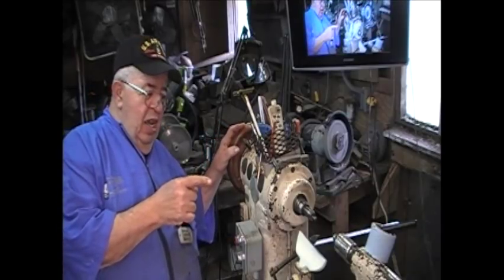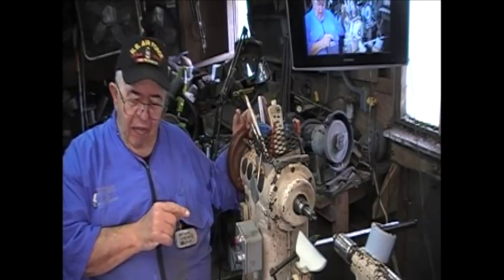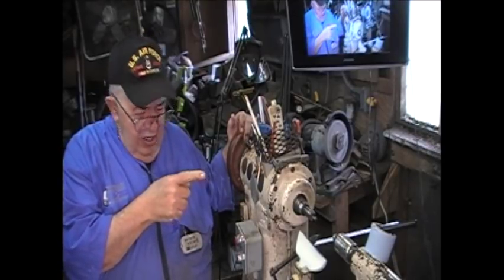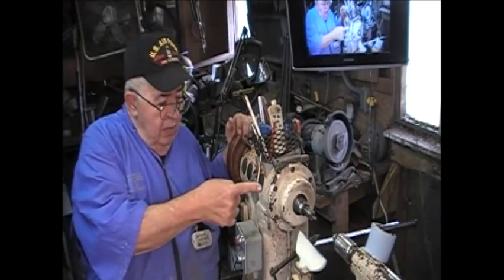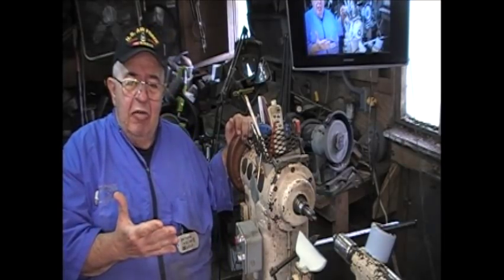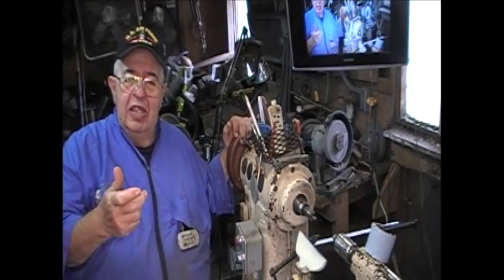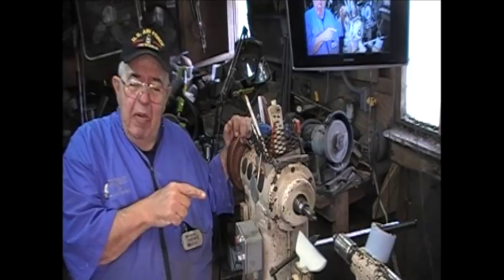But we're back on this. When I first got this mandrel, I only turned a wine bottle stopper. Then one day, I needed the top for a cane, and it was going to screw into a 3/8-inch rod sticking up out of a Cabela's cane. And I thought, well, that's 3/8, and that's 3/8. I can work like that. So I put that knob on this mandrel. Spun it on, locked it down, and it gave me a stable place to work. It didn't have to be between centers. I started to rough it in between centers, not to get any bruising to knock it off. And then when I got done, I could just unthread it off this, seal it, thread it back on the other one, and it was done. So you can do that with this type of mandrel.